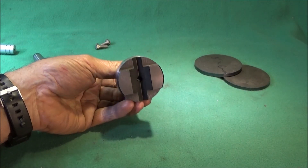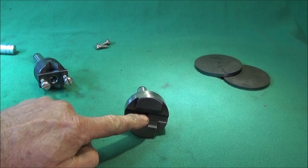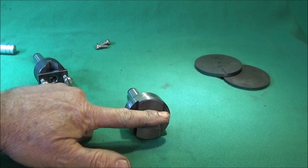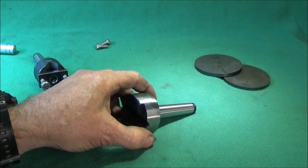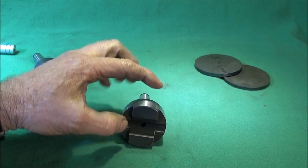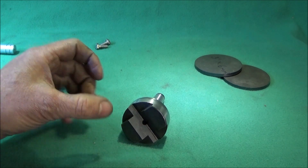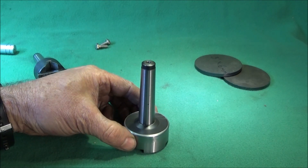In the next video I'll show you how I'm going to make the clamp for this one. I've come to the conclusion that it would be too dangerous to use without a clamp — your hand would be close to the chuck, the bar could flip out, and you'd have to keep realigning things. I do think that this adapter here is a part-finished item. I think these flats here were intended to be drilled for a clamp to go on, although I'm not going to use those flats — I'm going to do mine with the disc at the back.